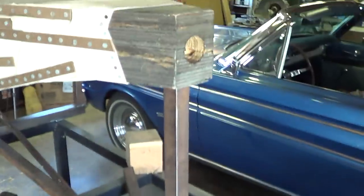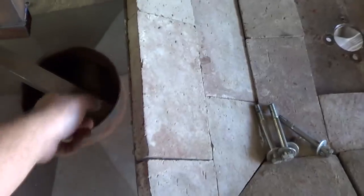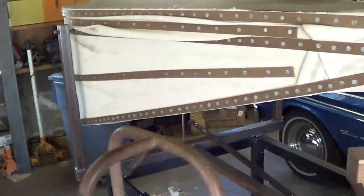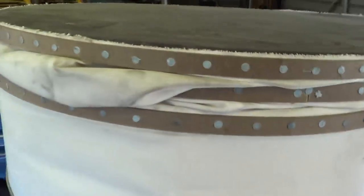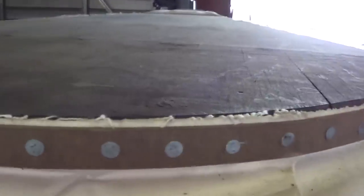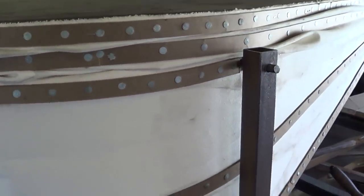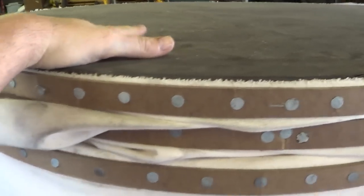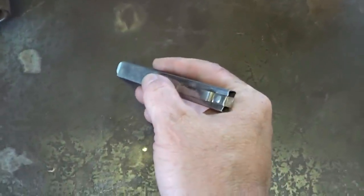Otherwise, we're going to focus on getting the air from the nozzle down a pipe and into the tweer. The issue is I still need to be able to control the amount of airflow. One of the ways they would control the airflow from the bellows was with a system of counterweights. The weight of this top board controls the airflow out of the nozzle. The heavier, the more air; the lighter, the less air. The faster it comes down, the more air comes out of the nozzle, and the slower it comes down, the less air. They did that a couple of different ways, I think. I know one way was a system of counterweights, so hopefully this will illustrate how they worked.